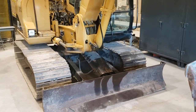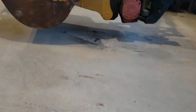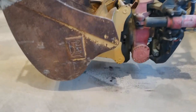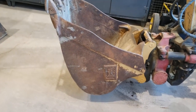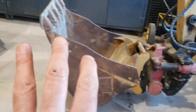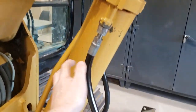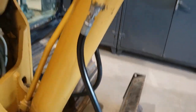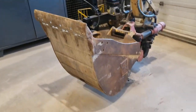We've got another machine here, a hydraulic excavator, and once again it looks like the machine's not parked properly. We've got an implement that's raised off of the ground. From certain angles it might appear that the bucket's sitting on the ground, but when you get down and look, you can actually see there's a space. What that means is that the whole front boom, bucket, and stick assembly is being held up by trapped oil on this side of the piston in this hydraulic cylinder.